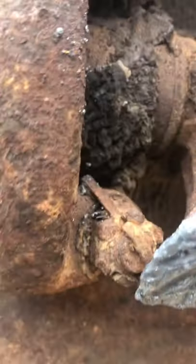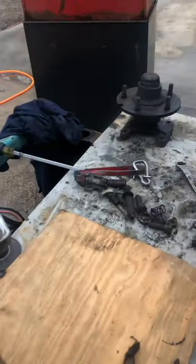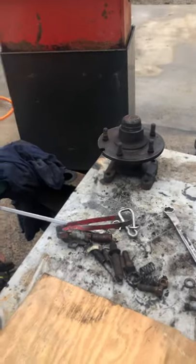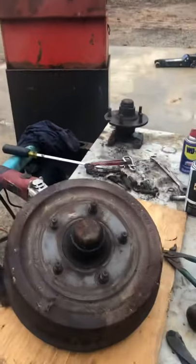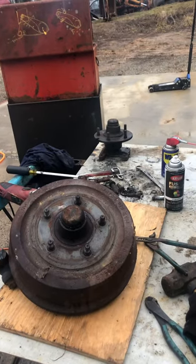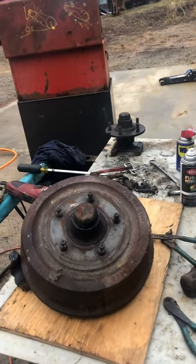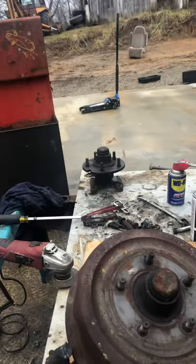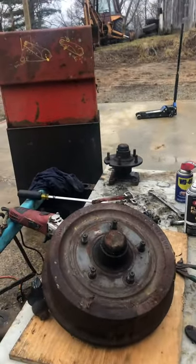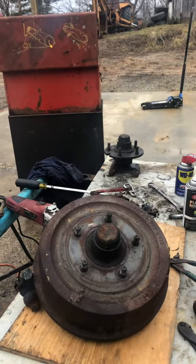That bolt, that bolt, that bolt, and that bolt - and then you take a torch and clip right through there, grind it flat, and you have a forged spindle that can be bolted onto any flat surface. Don't underestimate the amount of force on those bolts, so I'll keep the original bolts or bolt them on with grade eights, and I'll normally weld around them as well.